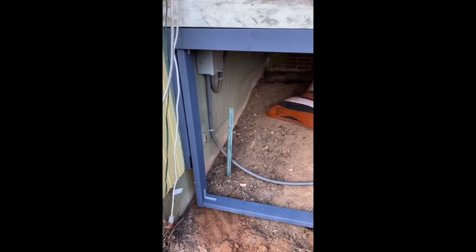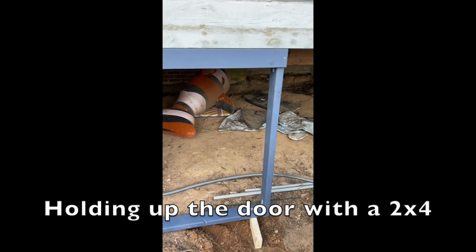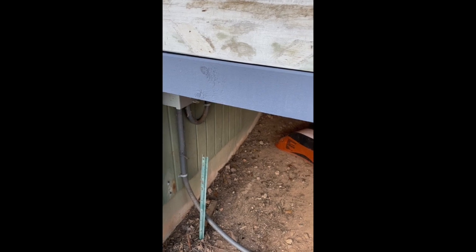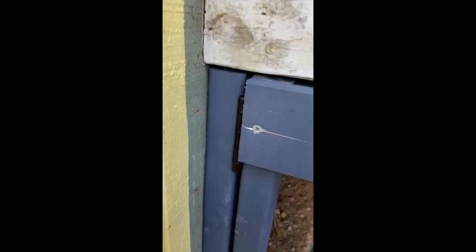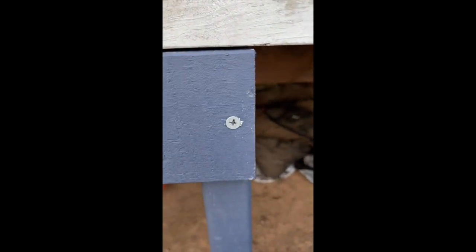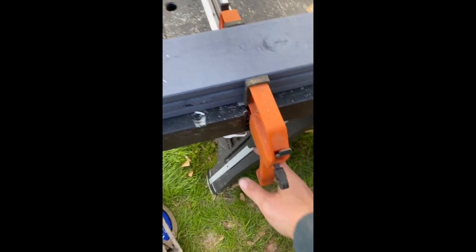So I got the frame of the door up, and I put the first piece of shiplap on, and I'm going to be using 1 board thickness in between them for the gap, about a finger's worth probably. It's actually about 5/8. But what I noticed was that first board split when I put the first screw in.